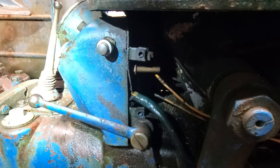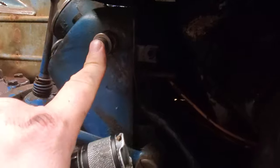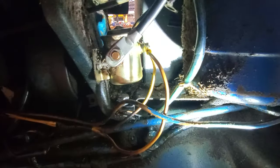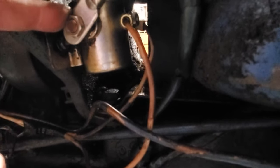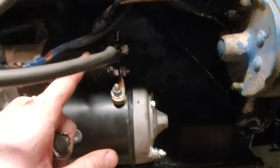On my tractor, the current setup — I believe this is an aftermarket switch, but it's just a push button switch. That was the old engager. There is a starter solenoid mounted here; they wired in the back side — the lead on the back comes from the battery. They also have one of these yellow wires coming from the battery as well, running to that switch, then coming back from the switch on this leg right here, tying in here, and then that sends power to the old starter.